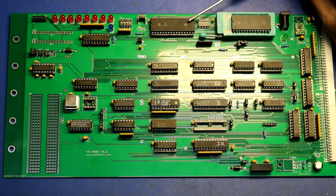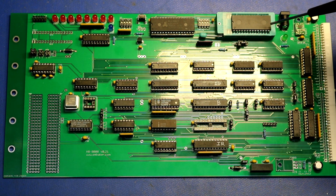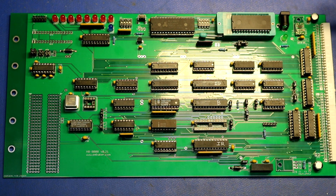So up here I have an AS6C4008. It's a relatively large 512 kilobyte RAM chip. We only use 32 kilobytes of that, but just for the sake of using parts that I have in inventory already. And over here we have a 28C256 electronically erasable EEPROM. That is a 32K part, and that has our four banks in it that we can store 4 different programs in.